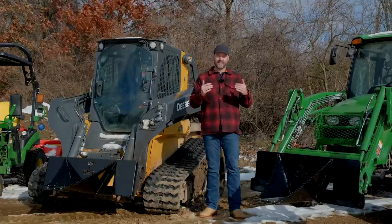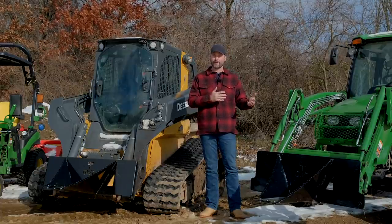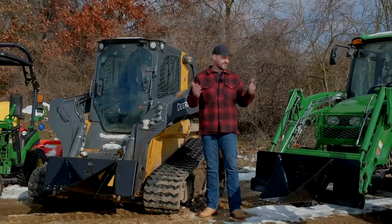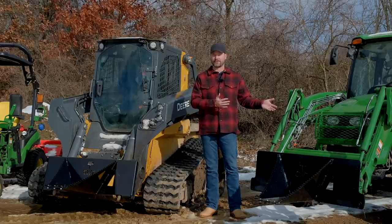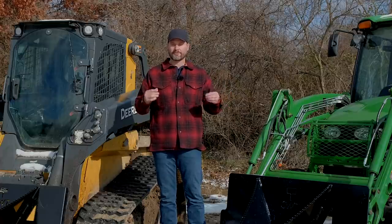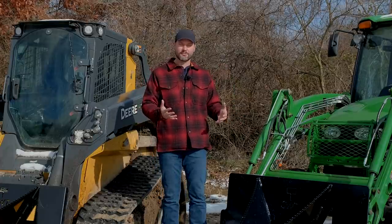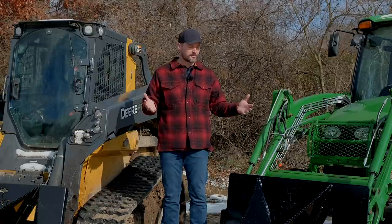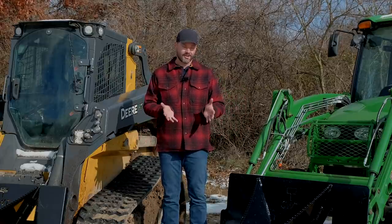And I hesitate to say that because horsepower is just one variable, right? You can have a 45 horsepower 5 series tractor, a 66 horsepower 4 series tractor, a 46 horsepower 3 series tractor, and it's a little bit all over the map. So a little bit of it's common sense, right? There's tractor weight, there's a tractor hydraulic system, and a lot of other variables coming into play: the weight that's behind the bucket itself, and the hydraulic system that's potentially pushing or tweaking that bucket is a huge component that goes into the design.